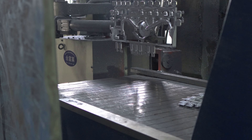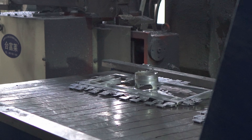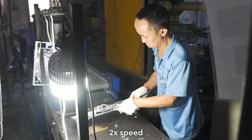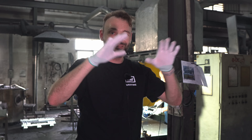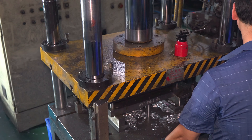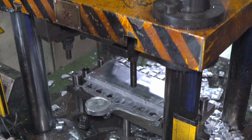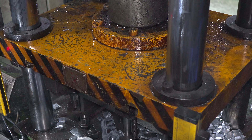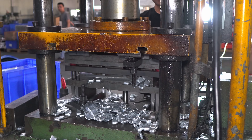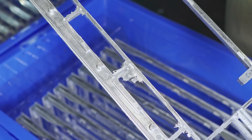You can see there's so much excess material around the top case — that's because it helps with the injection flow, having that entry point and those other points to guide the injection. We don't need that excess material around the top case, so this machine stamps away all of it, leaving only the top case. But it's not complete just yet, because on the top case there are still big burrs attached to it, and those are removed in the next step: the CNC machine.